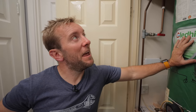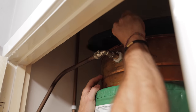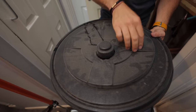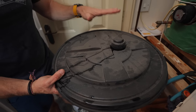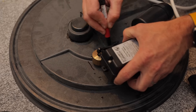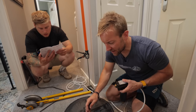So we're ready to do the bit I've never done before. First thing — take this lid off. Everything is going to revolve around this lid because we need to fix our float to it. The arm of the ball valve is like that, and we're going to try to keep our float kind of here. If it's bouncing a lot it might cut the pump in and out quite a bit which could be annoying. So we'll cut the lid there and there, glue it on with CT1 — there are no real fixing points apart from that.